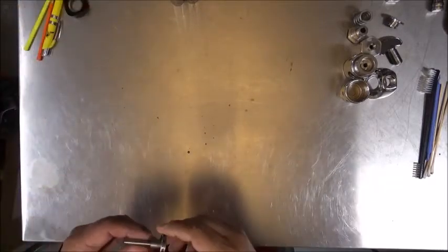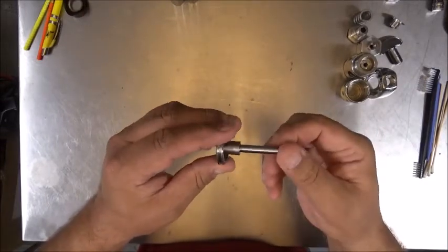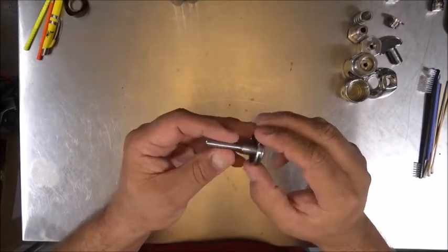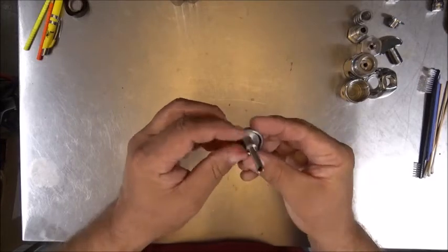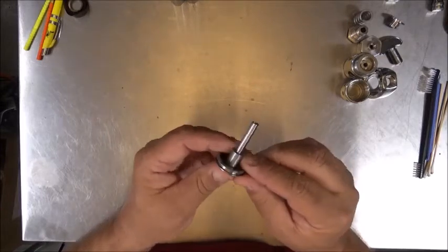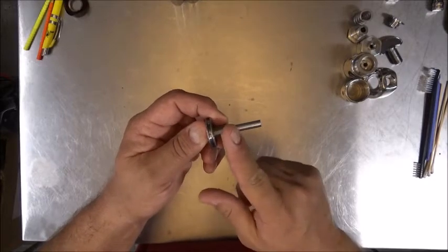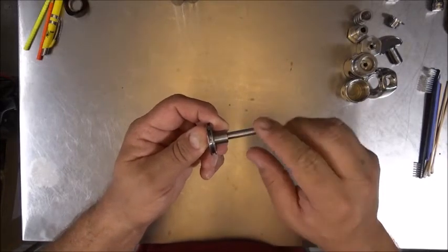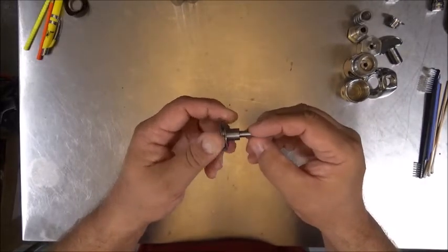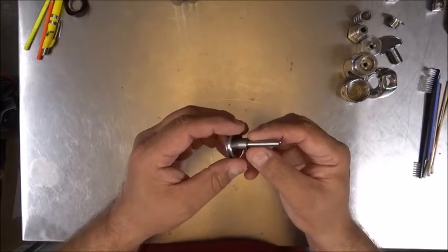So before we go on to anything about cleaning, remember I talked about the piston. Don't clean the piston with anything else. Clean it all by itself and treat it like porcelain, because you're probably not going to find a brand new Mark V piston. The key to the piston is it's got to be as clean as possible. This area on the shaft is where the dynamic O-ring runs, and if there is any corrosion, burrs, whatever, it has a propensity to dig into that dynamic O-ring. It's going to ruin your seal. Your IP will never seal. It's just a bad situation all the way around.